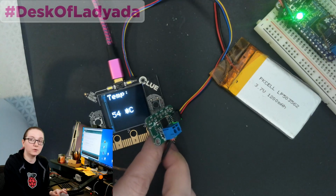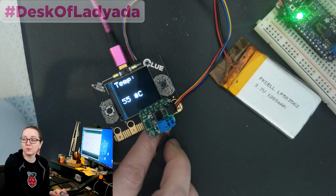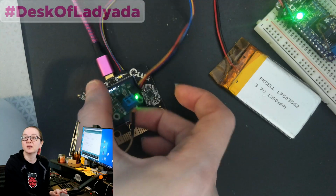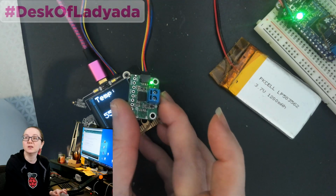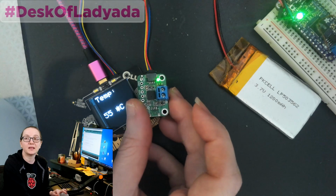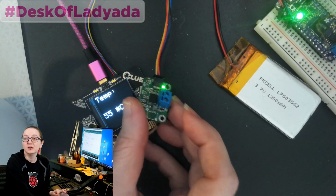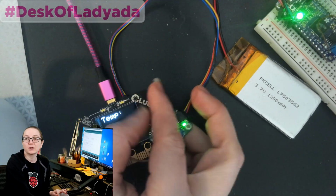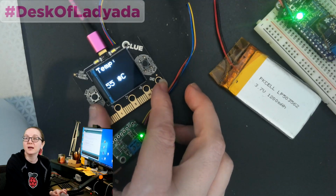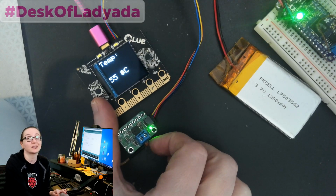We already have a version of this board, the 9600, but I designed it a while ago before we were trying to do everything with the STEMMA QT standard, which is like 1 inch by 0.7 inch. So this board is really nice and compact. And what I like about the 9601 is that it now has open thermocouple detection. This code won't print out "disconnected," but I'm going to add that next. I just finished this up. But it can detect if the thermocouple is detached, which the MCP9600 cannot.